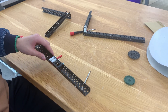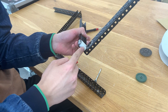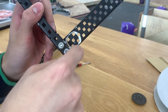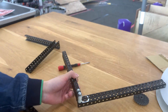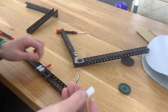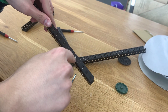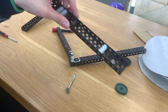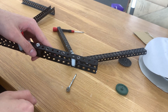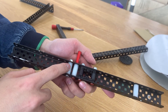I'm going to show some different variants of spacer boxing. Earlier we used a half-inch OD spacer that VEX sells — as you can see, it actually protrudes slightly over the C-channel and is a bit thick. You can also buy 3/8-inch outer diameter, 7/8-inch long spacers, which fit perfectly inside and sit flush, with the holes centered. You can buy these on McMaster — I'll keep a link in the description. This achieves the same result but looks a lot cleaner.